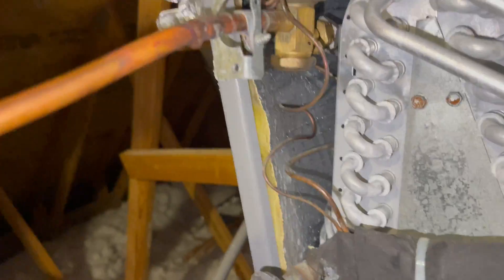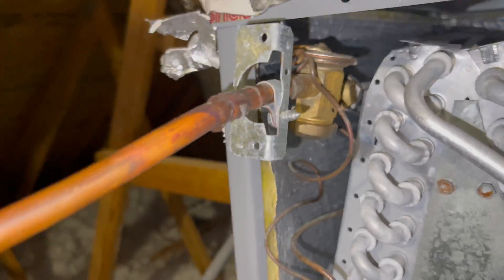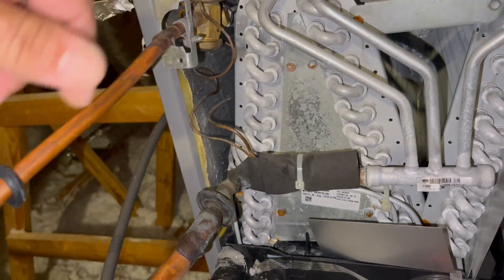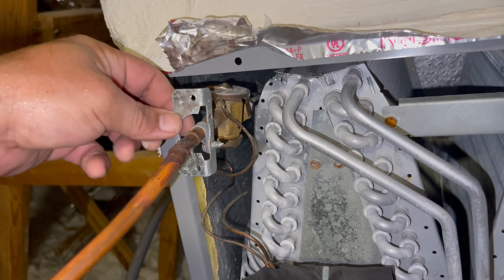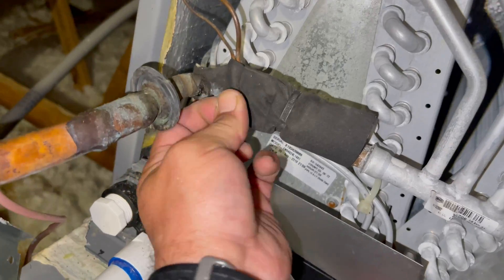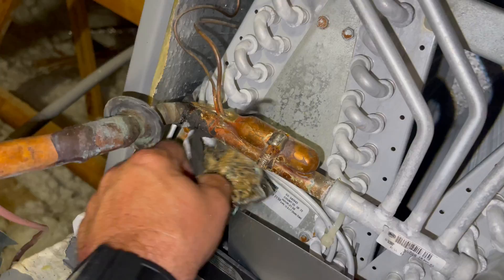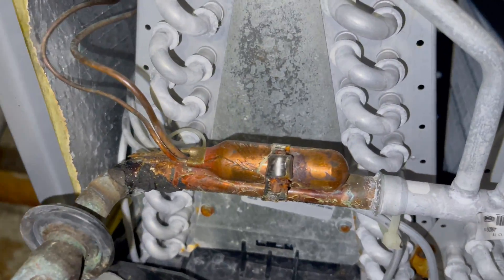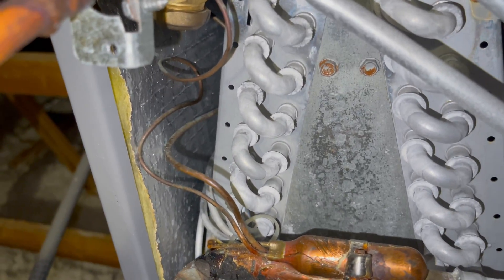It's ridiculous either way. So this is our TXV up here in this very awkward position and you can't get anything — you can't pull it out — because all of this is still connected. So we're going to have to unsweat this first, but we'll take this clamp off with a five-sixteenths screw. We'll get this bulb taken off and then we'll be able to see that area where we're going to be removing this line for the external equalizer.